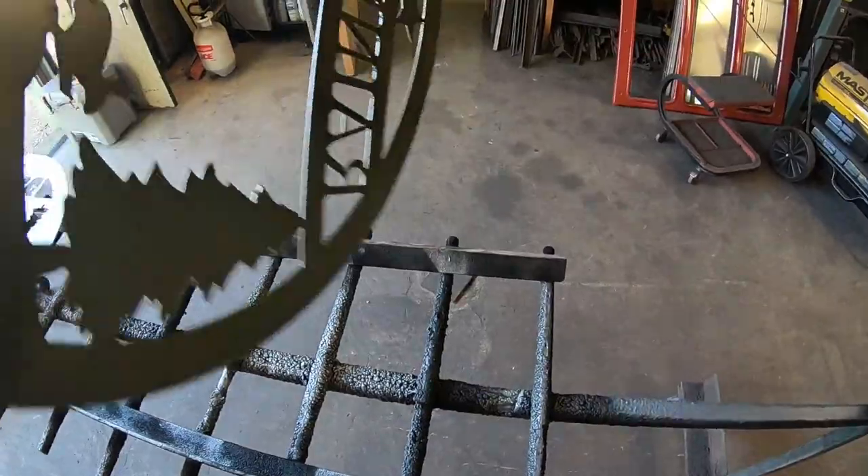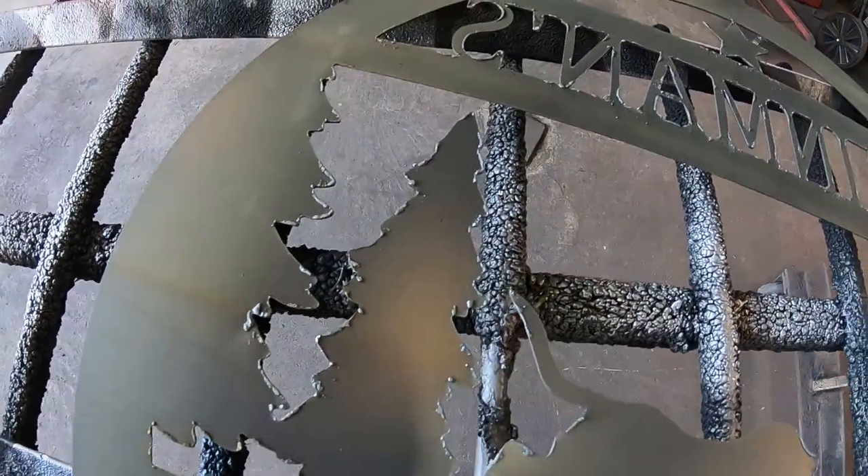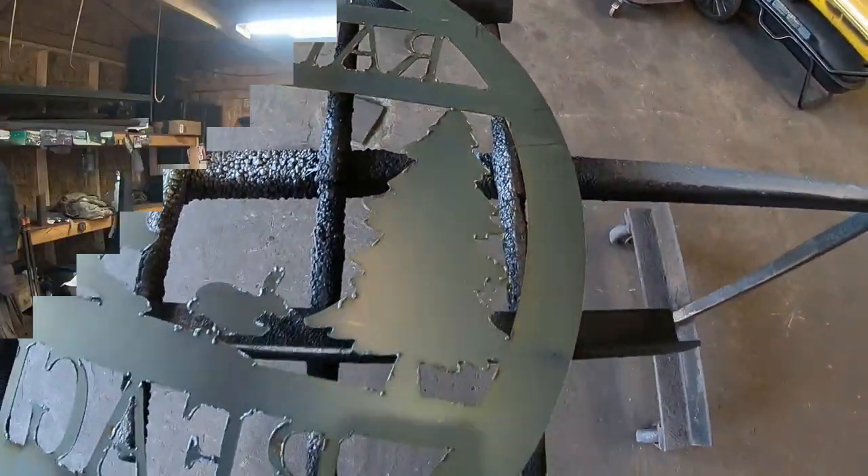I think the sign turned out fairly well. Fresh off the table, got to get the wire wheel on it, get her cleaned up. You can see the back side here — she's still a little bit warm, not too bad. Tips are doing fairly good, not too much slag. I'd say we've cut about a dozen signs — 10 to 12 signs — with those consumables, and they're still holding up fairly well. It all depends on the thickness of metal and the signs you're cutting.